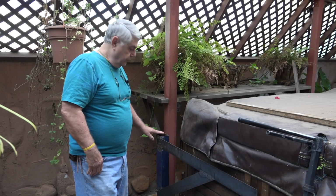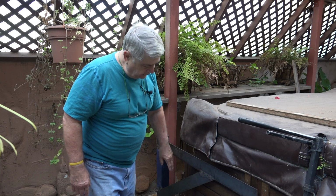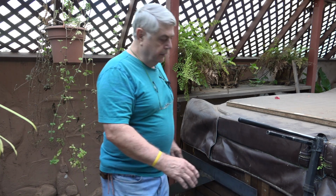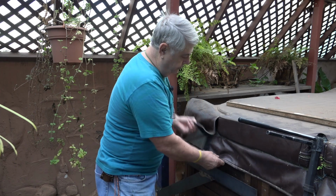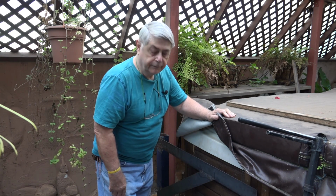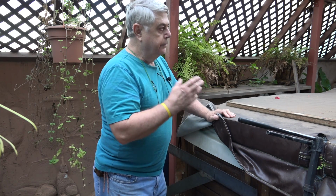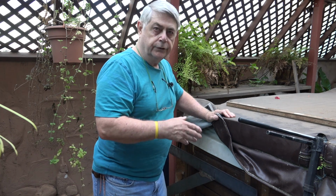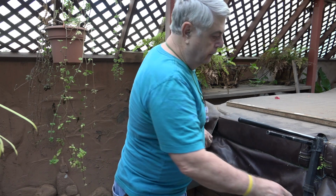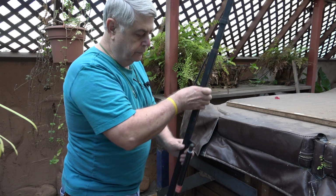The first thing I did was weld this stanchion up, put this crossbar on it, and a 45 degree support. This mechanism was screwed to the thin, it's like 3/8-inch paneling that's on the side of the spa. And this is a very heavy jacuzzi cover. It's a 6-person jacuzzi. So when this thing lifted, it put a lot of strain on the mounting screws.